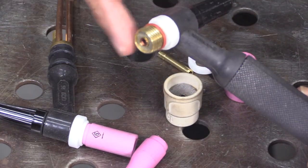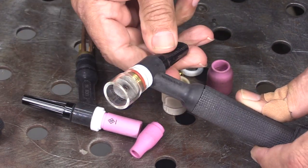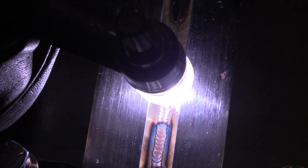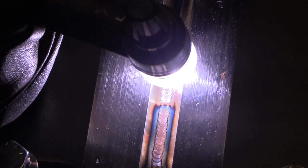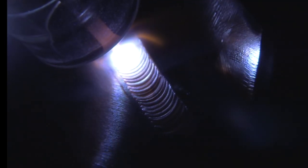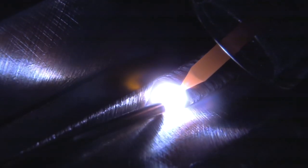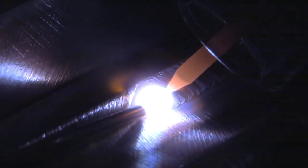As you can see, I've slipped the O-ring down on the base of the gas lens and moistened it. Now I'm ready to slip on a Jazzy 10 cup or other clear cup. This is a really good example of the large area of gas shielding you get with a Jazzy 10. It also kind of lights things up because it really is like a light bulb — there's a tungsten lit up inside a glass cup that really lights the way for you.